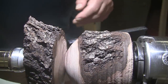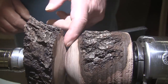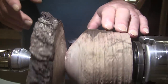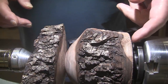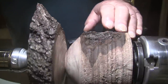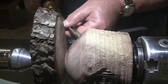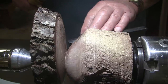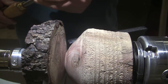I've been standing here looking at this and I think I made a mistake. I hope it's not a really big mistake — I made this pretty thin down here, which is fine, that's what I had in mind, except that I forgot this is end grain and it's not strong. And when I start hollowing out the inside, I'm afraid that might break off. So now I've got a half-inch standard grind bowl gouge and I'm going to approach from this way and round this piece up. I've installed a six-inch tool rest so I can get in here a little tighter. We're going to be turning at 1000 RPM — mask and face shield on.